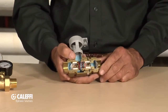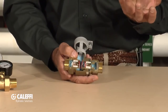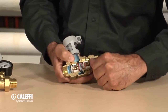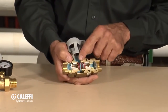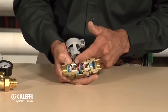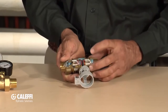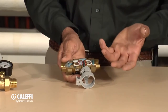What's important to know about backflow preventers is what can happen on a system where you have a valve that shuts off quickly — typically like a washing machine solenoid fill valve or a dishwasher valve. When those solenoid valves shut off very quickly, they cause water hammer, and that water hammer comes back to the valve and makes it bump quickly. Over time, if that happens occasionally or every day, you're going to get a little deposit on that seat, or some debris coming through your incoming water can cause that valve to seep — and you'll find a drip coming out of your backflow preventer. With Caleffi, we make it very easy for you to disassemble this valve and clean it out. The valve doesn't need to be replaced — it just has something stuck in that seat that you can get in and service.